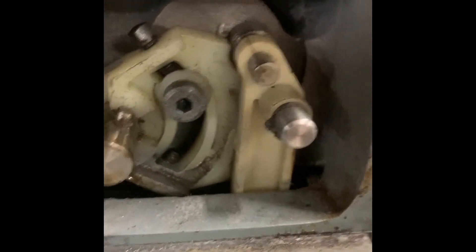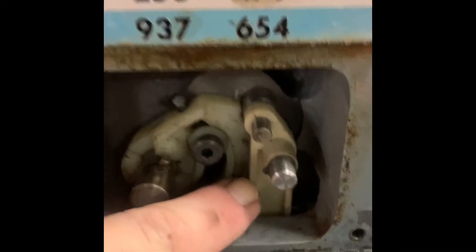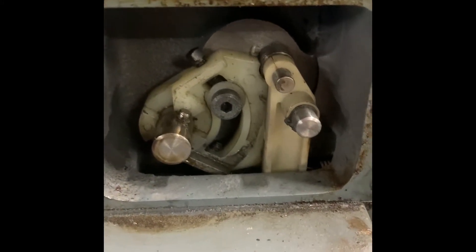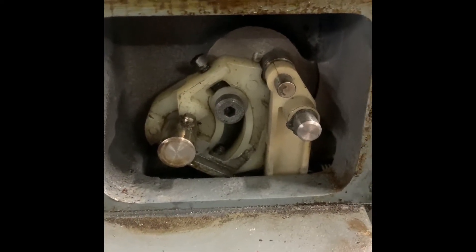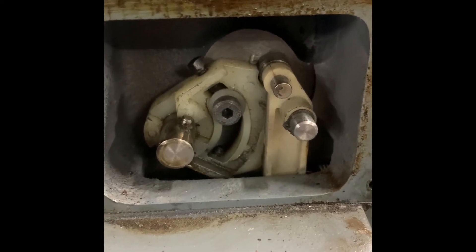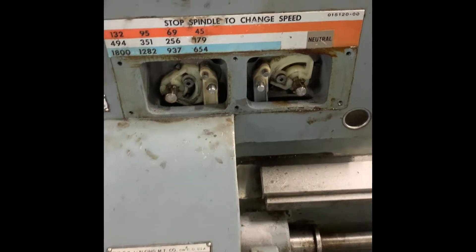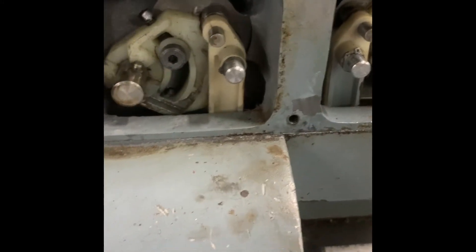When that cracks, this piece completely falls off and there's nothing keeping it in gear. It'll slip out of gear if there's any force in any direction other than right where it sits, and your headstock gears will bang together — or slip out and try to mesh into the next one and destroy your headstock. So just another thing that's serviced. If you're doing this yourself, make sure those are in good condition before you start running the machine.